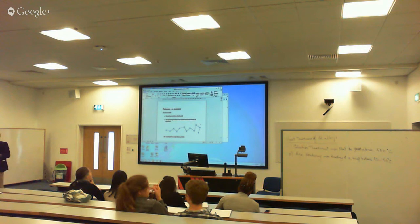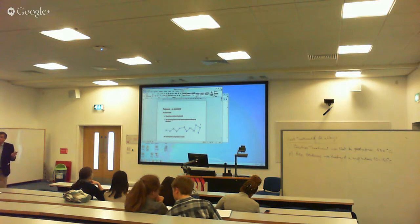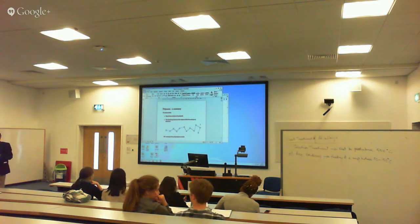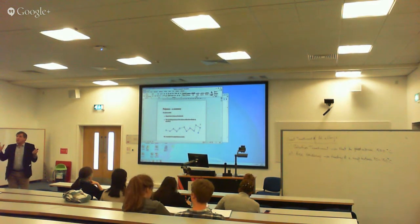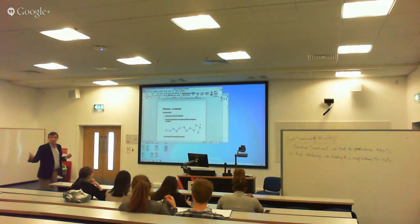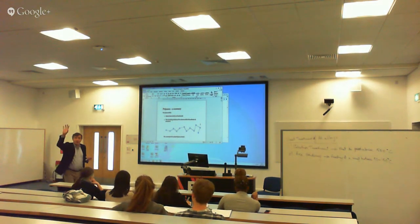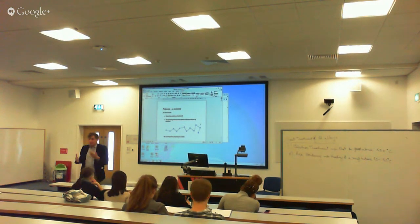One is very low alloy copper, almost pure copper, that is mainly used as conductors for wires, cables, etc. Very low impurities, almost pure copper, sort of 99.5% copper. That's mainly for conductors. Then we have two main alloys that are used for products.